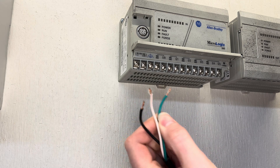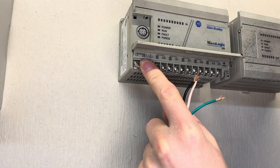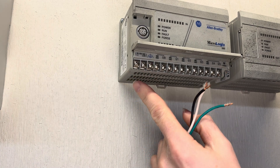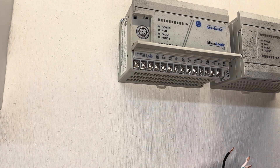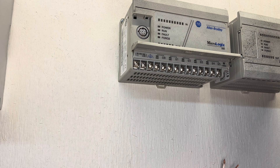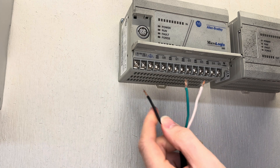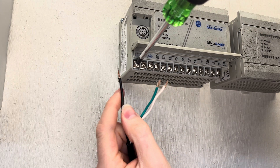Most of this is probably pretty common. You do have the ability to use anything from 85 to 264 volts AC. So if you wanted to take line one and line two maybe from a three-phase 120/208 system — that'd be a Y configuration — or you could take it from a Delta via a 120/240 system, or maybe you just have a 240 volt system coming in. In this case, we're just using a 120 volt system, which would be common household power or a common three-phase system.